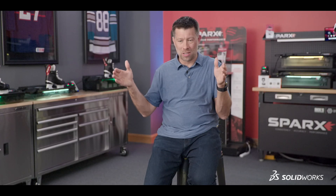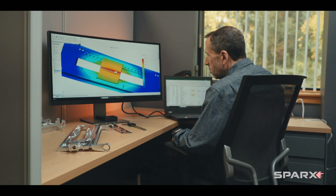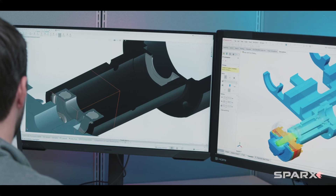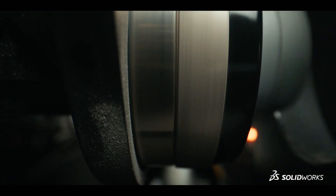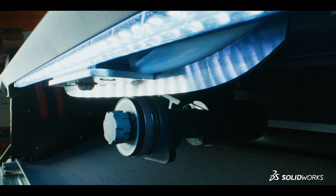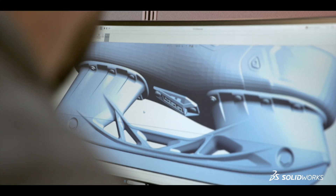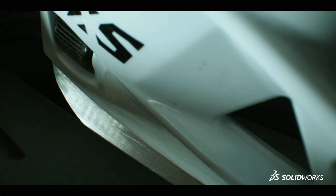Using SOLIDWORKS, we had seven or eight parts that were obviously an extrusion, and a bunch of components could easily be a casting. But the casting needed to be as strong as the extrusion. So we were able to use simulation to design the final casting, ensuring 100% that it will be as strong as the extrusion, and all those features will be put right into the casting. The ability to move things around in that early stage and iterate on that quickly is invaluable for doing that analysis.